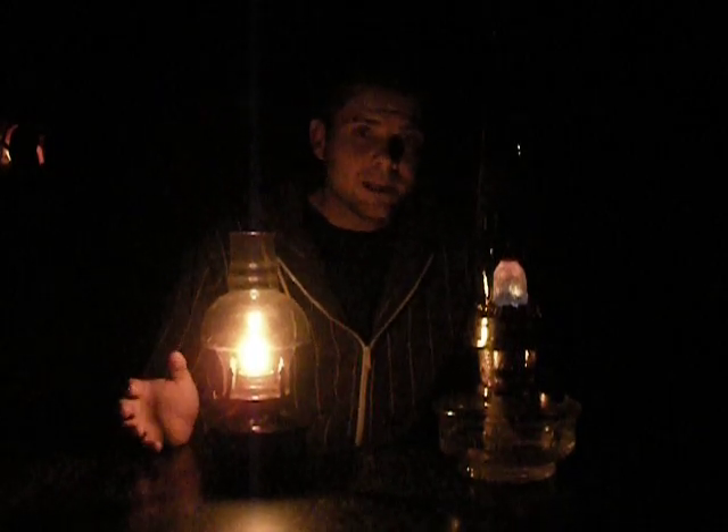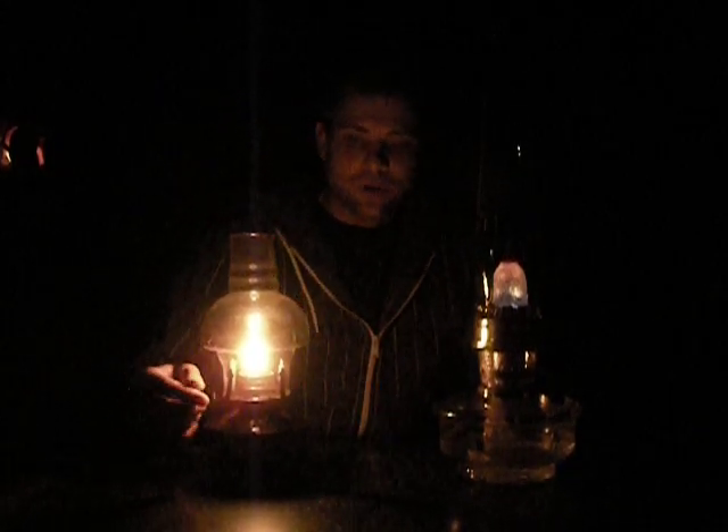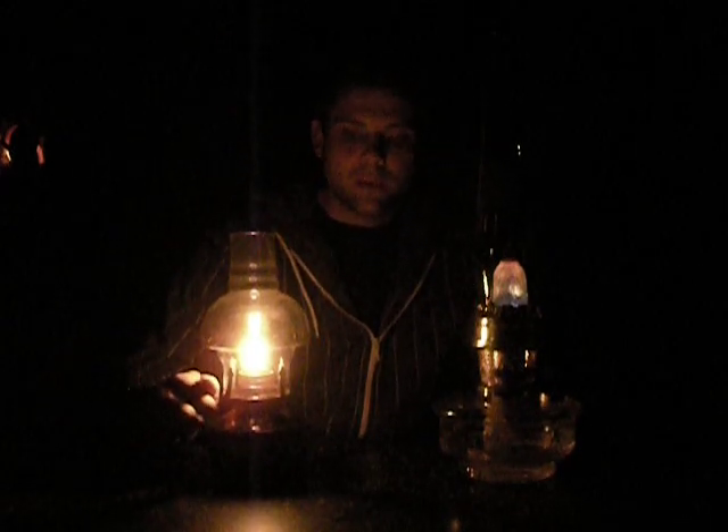The Aladdin on the other hand has an incandescing mantel. I'm going to turn this one down and then work the Genie up. I'm turning this back down to just below — this is what you'd leave it on if you were just letting it glow. Now I'm going to move it to the side. On the Genie, I've already had it running, but I'm turning it up now. I'll give it just a moment to make sure it starts to get hot at about 20% — it's been running several minutes — just to make sure I don't make any black spots.